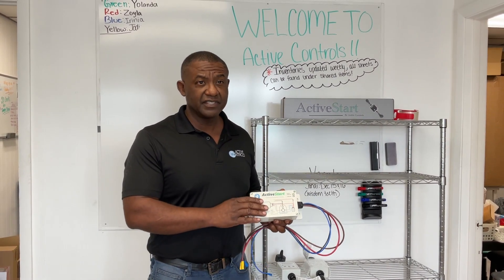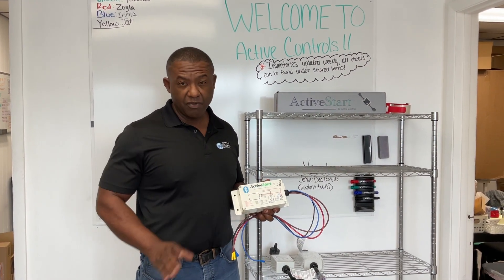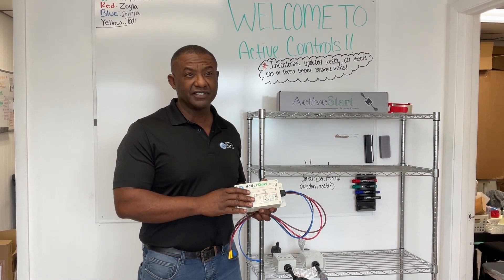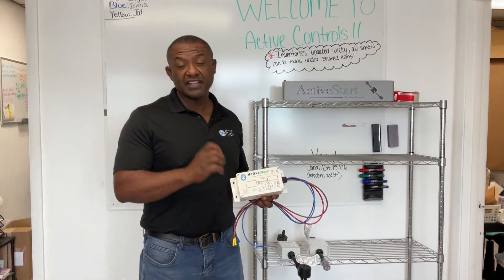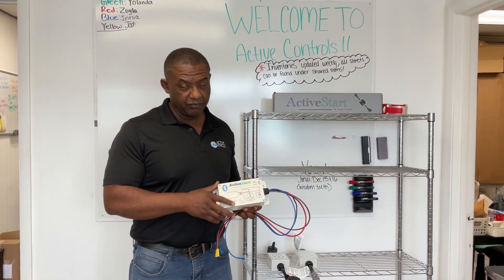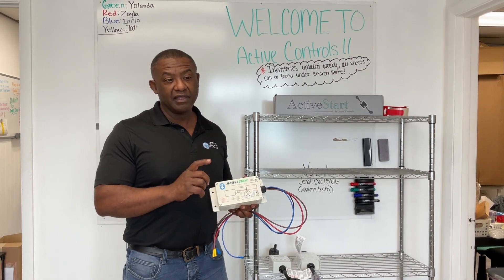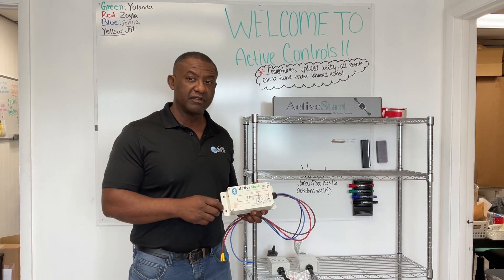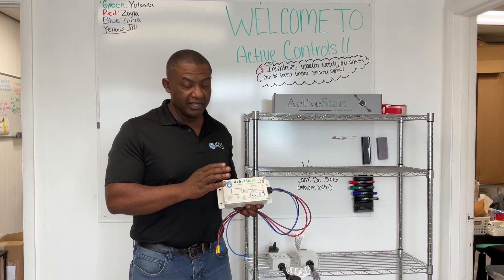This tested continuously gives you 80% reduction from a small compressor to a large compressor. I've consistently gotten 79, 81, 82% reduction. That's measured — not based on the locked rotor. That is measured before and after installation of this. That's a big difference. A lot of people claim locked rotor amps, the rating, but never show you the pre-measurement. Check out my YouTube videos — I show pre and post. This is the best.